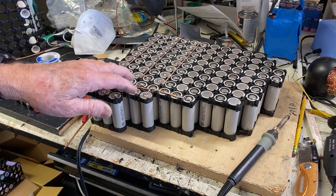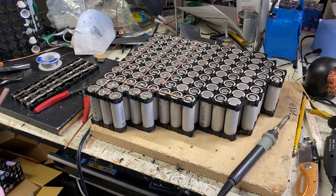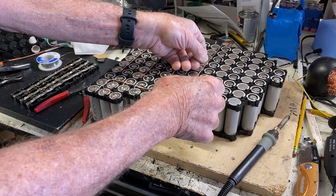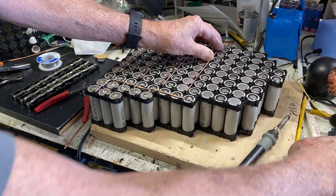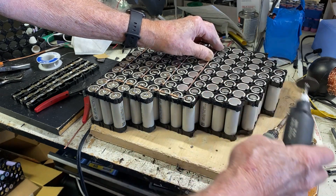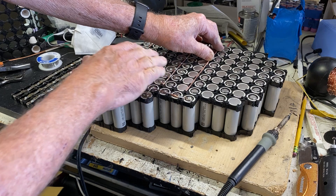You can see I have one, two, three, four groups tied together. I'll show you how I started doing this. I start with a piece of regular number 12 wire and set it right down this trough right here. I'm going to actually dig the trough out with a little grinder — grind the notches a little bit so it gets a little bit deeper in there, so there's less depth on the battery in the final product.